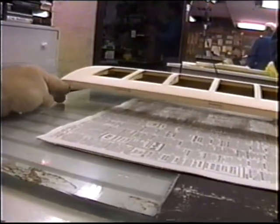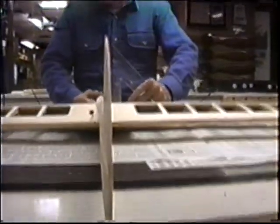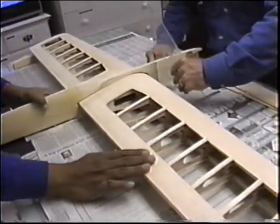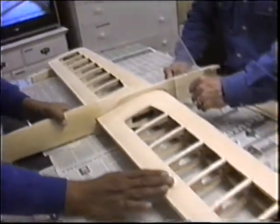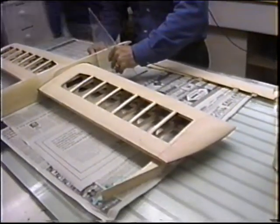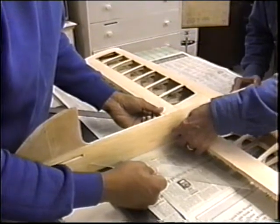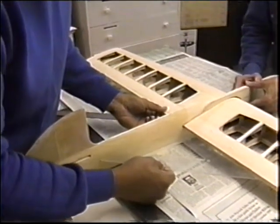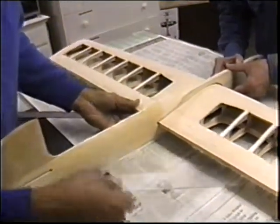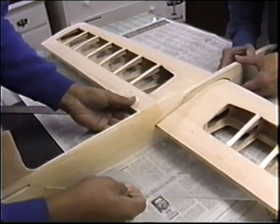That's 90. Now each wingtip should be the same off the table. Kenny, you want to measure this? Just get each wingtip. It looks pretty good. Just measure at each wingtip. You've got that at full 90. Need another little bit under each tip. I'll just hold that at 90. As long as we know we have enough, you want to be able to float that in there and get a good joint, before we put any glue on it. Don't touch that. Just get 90. You've got the other side at 90. It's off again. Okay, get it really close, and then let's scribe the side so we know exactly where this is going to go back once you put the glue on.